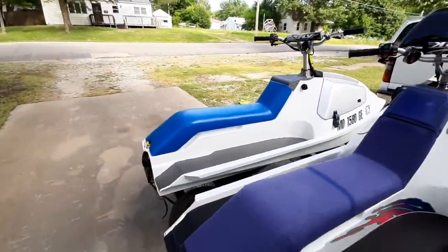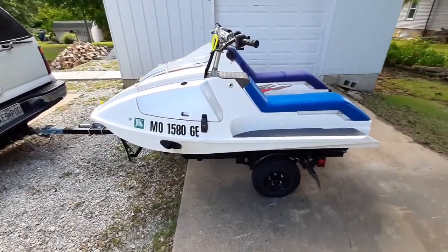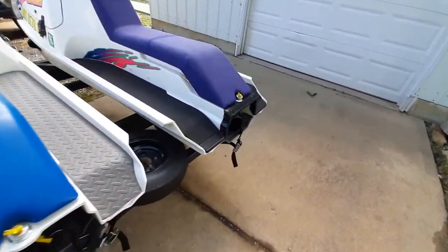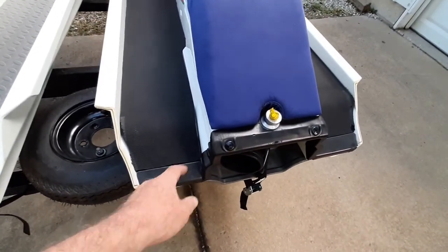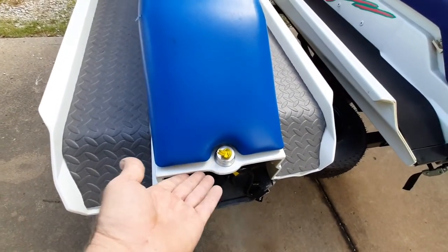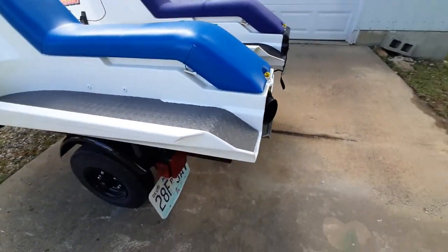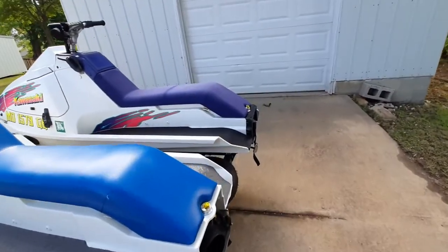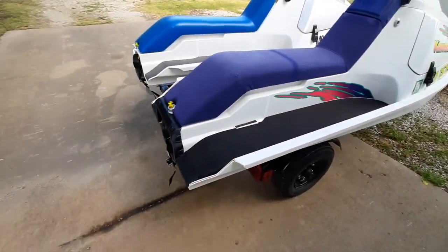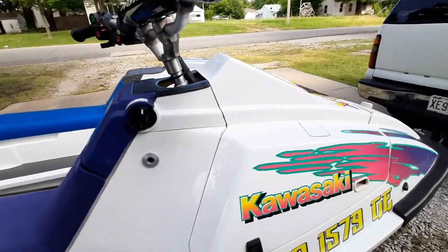Mine over here is a '92 model — it was a little more beat up, so we've done some custom work on it. One of the first things we did: you see how the back of his has the plastic trim around all that — mine was all falling off, so I cut the back end back just far enough to get rid of the bolt holes. On both of them we shaved the sides down — they used to be squared off — to keep you from whacking yourself on the corners. Since mine was busted, we also added bilge pumps to both of them.